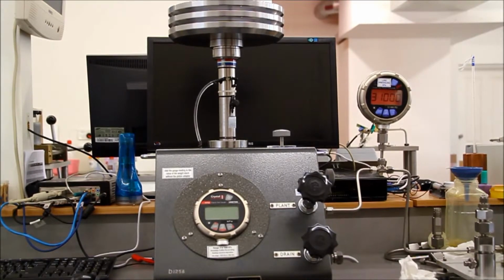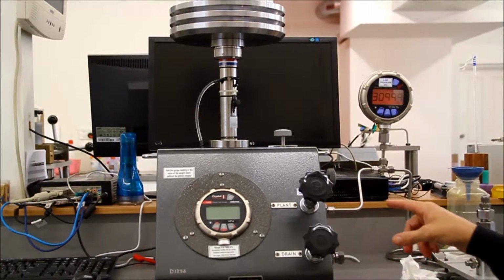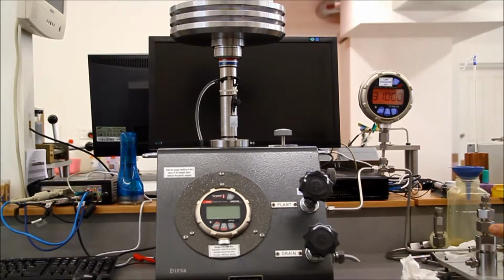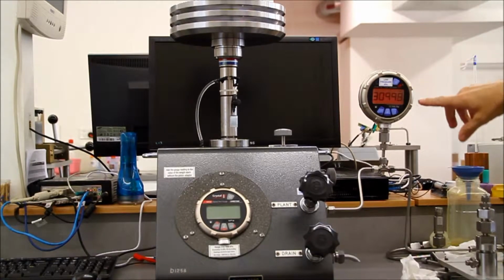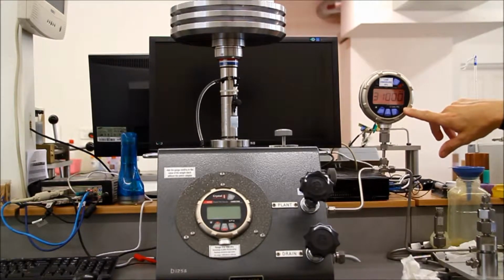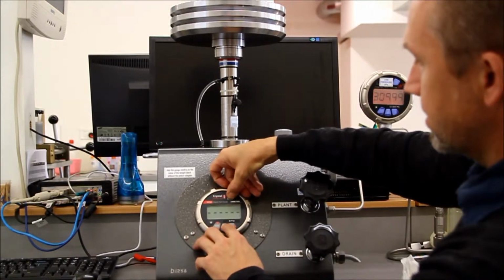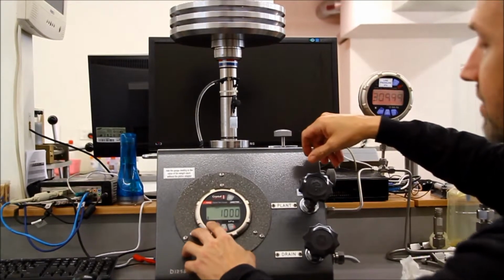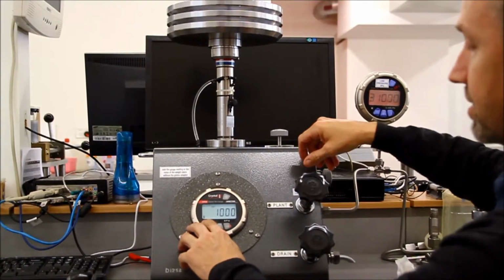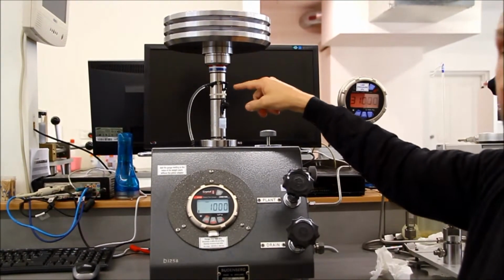So in this setup we have the DH-Budenberg Model 80 deadweight tester set up with a pipeline pressure being simulated by another deadweight tester externally, and that pipeline pressure is being indicated here by the use of a digital pressure gauge, and we're supplying about 31,000 kPa for this exercise. This digital pressure indicator then is operated and is connected in circuit to some tubing which is connected to the auxiliary bearing on the piston cylinder unit.